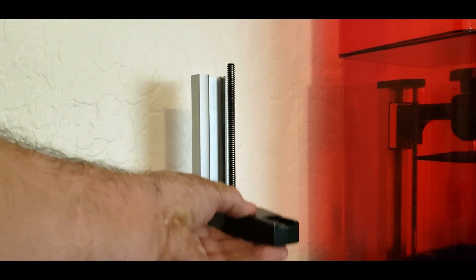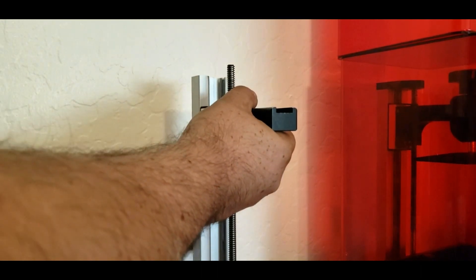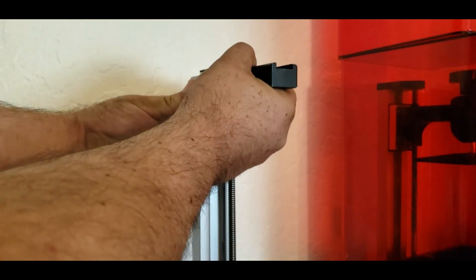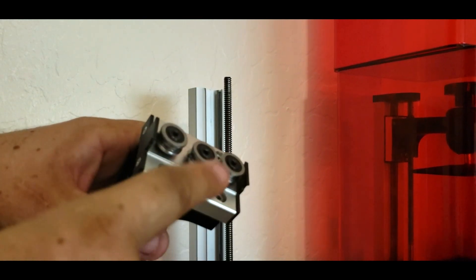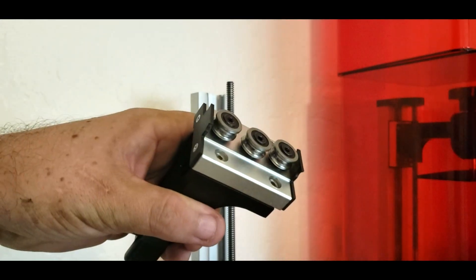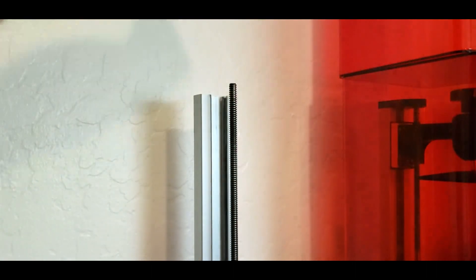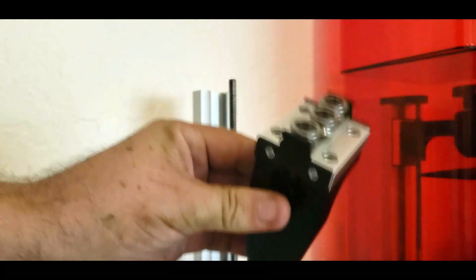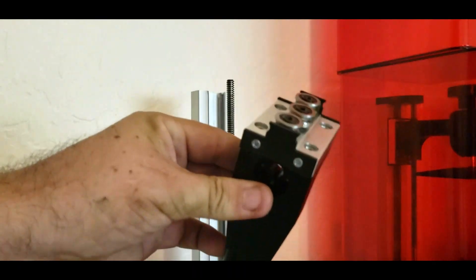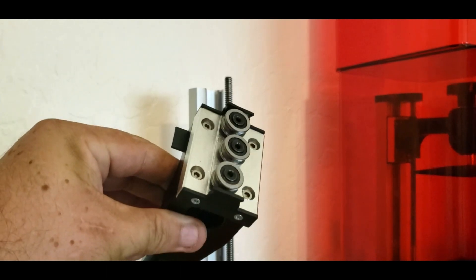When you hold back here and pull this out, this arm's backbone actually flexes — so as soon as you pull it off you feel it give a little bit. We're going to adjust this bearing block assembly so this just drops on and falls under its own weight. Once it falls under its own weight, that's where we want it to be, and we'll get much better printing results.